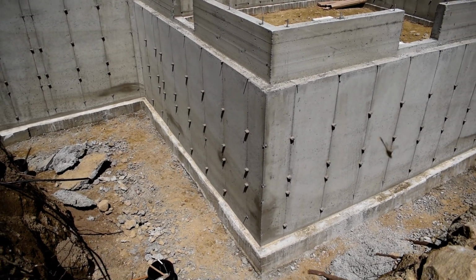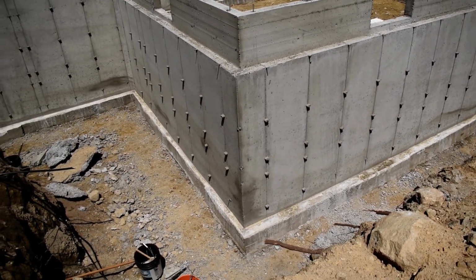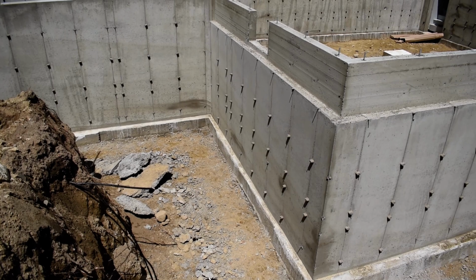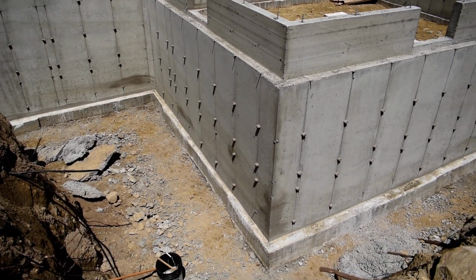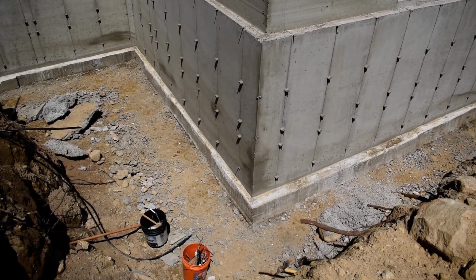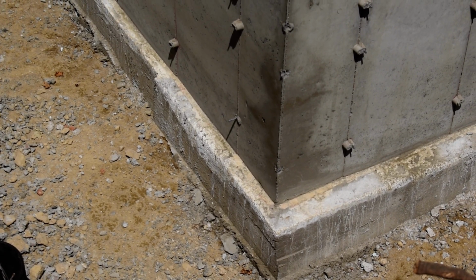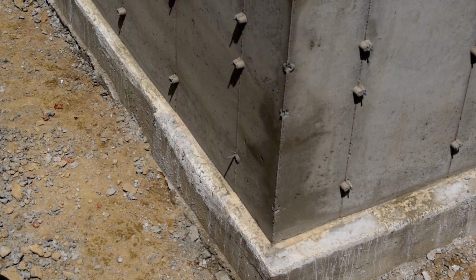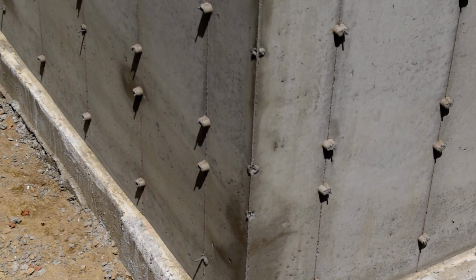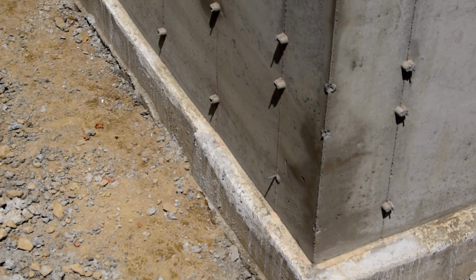It'll also dry or draw water out from the basement wall itself, which is kind of a nice effect, but that's only while it's curing. And then it's just totally a rubberized coating that's 100% waterproof. Nice thing is that it will seal all the little cracks. Transition from footer to wall is always a tricky one with a peel and stick membrane, to get that tight. Usually you have to do like a chamfer detail, put some extra material in there so it's an even transition between your footer and your wall.